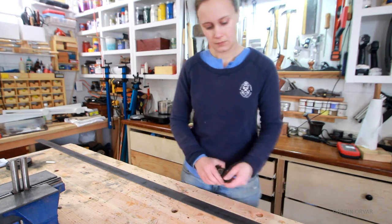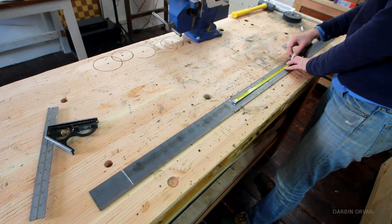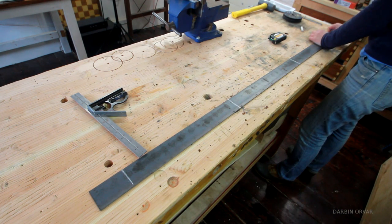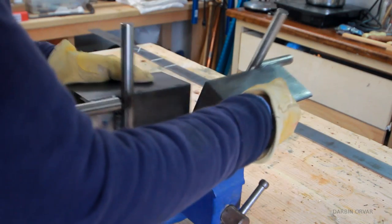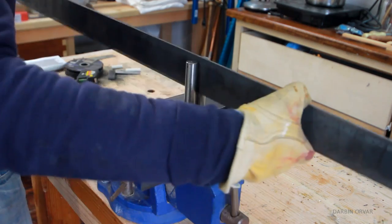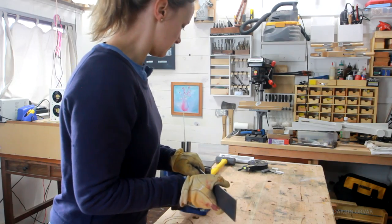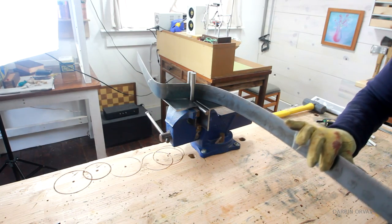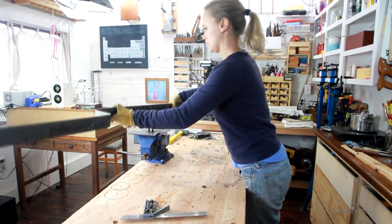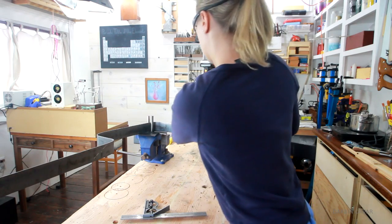Now let's move on to the base. I've got some one and a half inch wide, three sixteenth inch thick flat bar steel. I'm measuring out where I need to bend the metal — going for a 17 inch height with the table top, so I'm bending the metal at 15 inches. I was first planning on simply hammering and bending the metal using the vise alone. However, when one of my patrons, Tom Zelikman, heard about what I was planning, he offered to make me a jig to make it easier to bend the metal — I'll leave a link to his video below. You simply put the jig in the vise, put the steel in between the bars, and it's quite easy to bend. So I was doing some tests first, bending the metal on the marks.